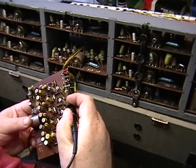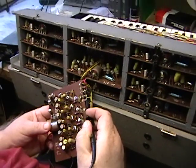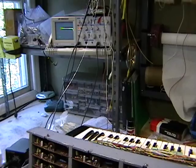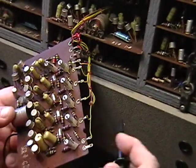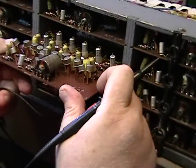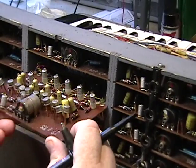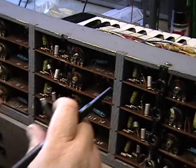Alright, this is the G sharp board, and we've got our dividers, and they so far are all here. Yep, all the dividers are here, so it's not an issue that is a divider or board problem. If it's not a contact problem, it's not a board problem, the only thing left is the switch. Well, maybe we need to re-examine the contacts again.